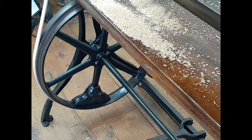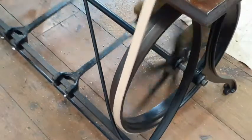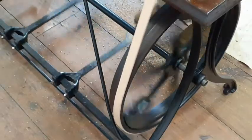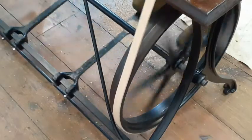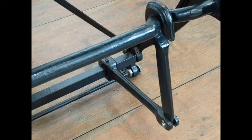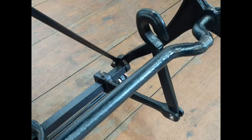The flywheel has a counterweight that positions the pedals such that they are ready to go by pushing down on either or both. This eliminates positioning the flywheel and the pedals by hand. Pedals slide along the rear square rod allowing the operator to position them as best fits the work. The location of the pitman arm at the far end keeps it out of the way of the operator, and its design allows it to disconnect from the shaft if the operator's foot were to get under one of the two pedals.